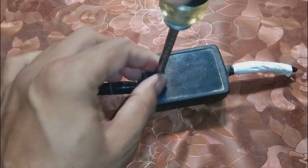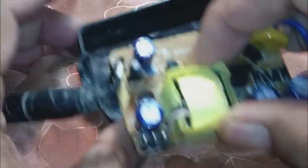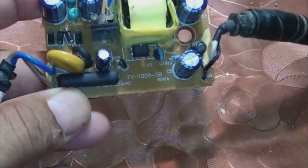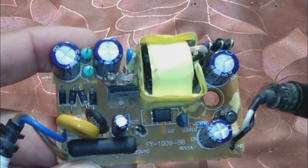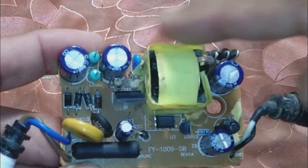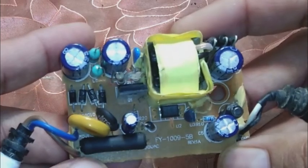Now I am going to open this. Here is one screw — only one Phillips screw. I removed it and I am going to open this cover. You can see I removed this cover and this PCB from this cover will come off like this. Looking at this PCB — the people who are expert in electronics know this very well, but for new people I am explaining everything. Here you can see this yellow transformer. These yellow transformers are normally located in power supplies and also in inverter circuits, so either it's an inverter or a power supply.